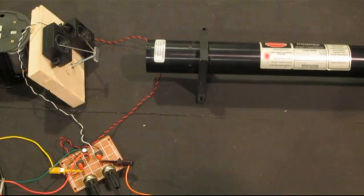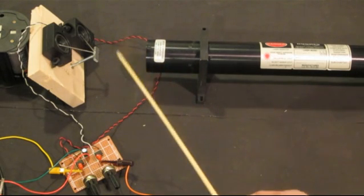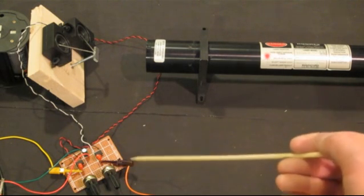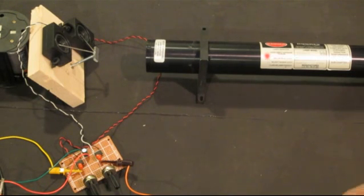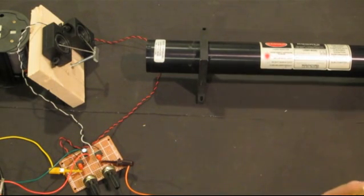The laser output shines on the surface of the mirror, which is reflected to the ceiling. To drive this laser oscilloscope, I built an amplifier — one for each channel. Most speakers are in the 4, 8, or 16 ohm range, which is quite low, and the impedance is significantly lower than what most signal generators expect. The chips I used are TDA7052s, but you can use any amplifier chip — LM386 would be sufficient.